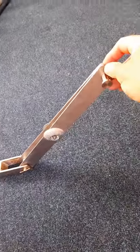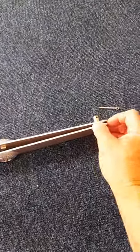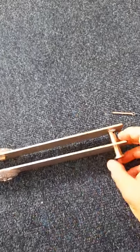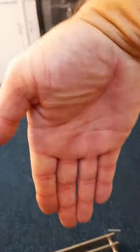The whole thing will wind up the centerboard. You've got a pivot point here and another pivot point there, so this mechanism will effectively flex as the centerboard comes up. As the screw winds inside there, it will slowly bend because the centerboard is not solely attached to this — there is a main pivot bolt through the hull of the boat through the keel, which carries the centerboard. This goes through the other hole to raise and lower it, so the centerboard swings as it comes up — it doesn't just go straight up and down.